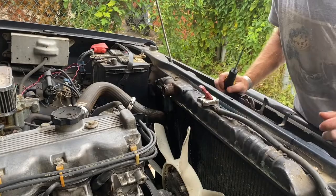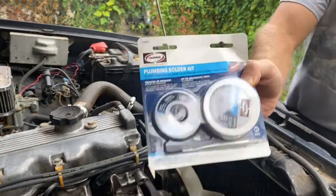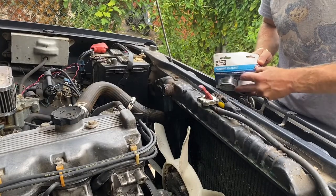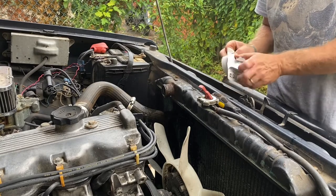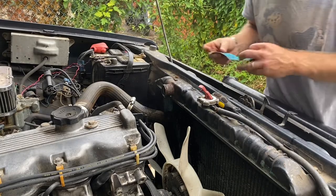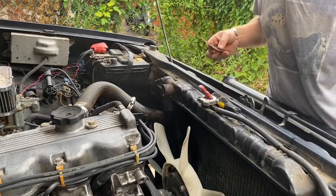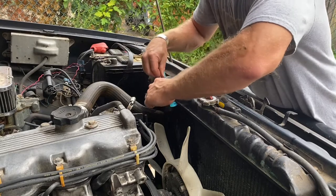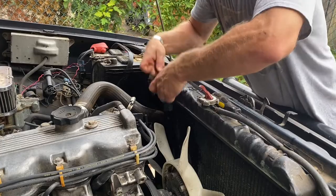Now we've got to get this cleaned up so we can figure out exactly where that leak is. I don't know if I bought the right thing, but what I bought was a plumbing solder kit — it says copper, brass. I think those are sort of close. The reason to get the kit is it comes with emery cloth, flux, and silver solder all-in-one — and they'll be the right ones for the job. If you go and buy individually, you might buy the wrong kind of solder or the wrong kind of flux. So get a kit.